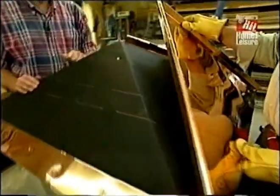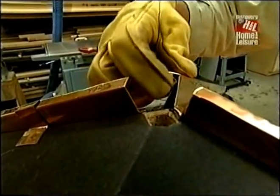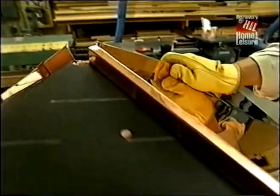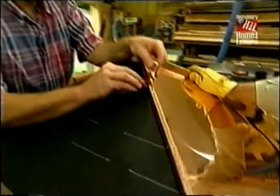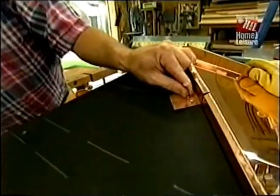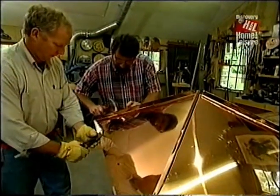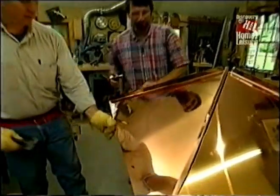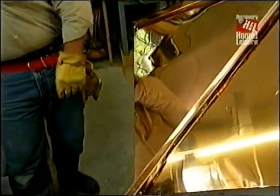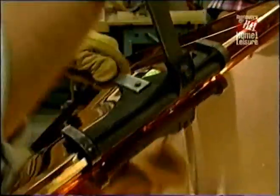Here's the roof panel that we made just a few moments ago with the double lock that engages our single lock side. Okay, I see that. And if you could nail that clip on while I hold it in position. Okay. Okay, now we can close up the lock on our first standing seam. Okay, see, so that tool just bends it right up underneath.